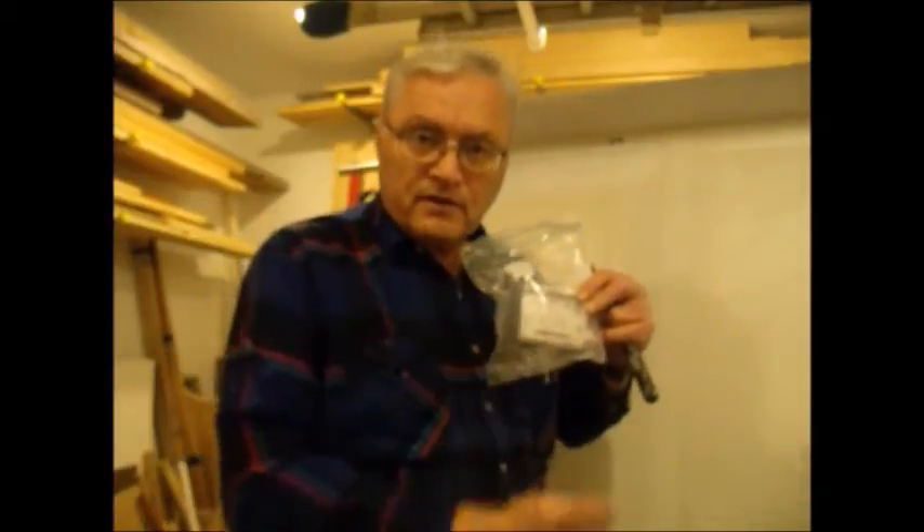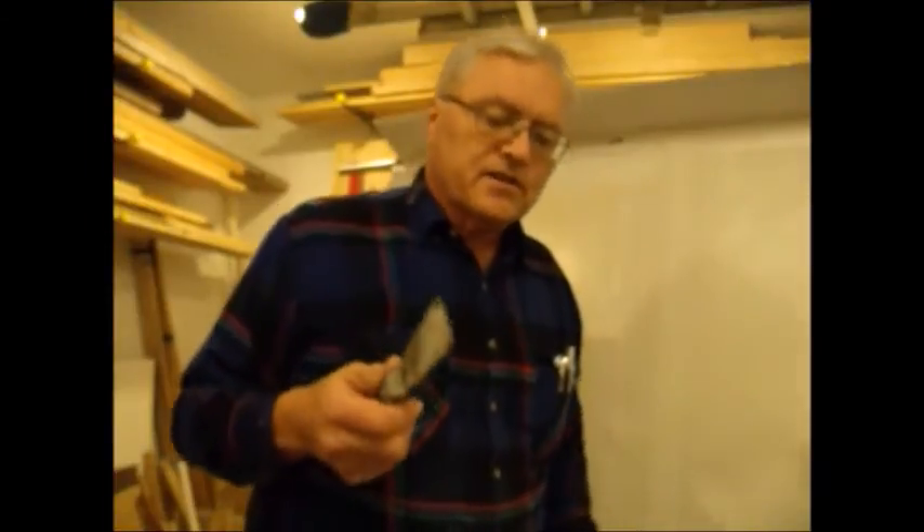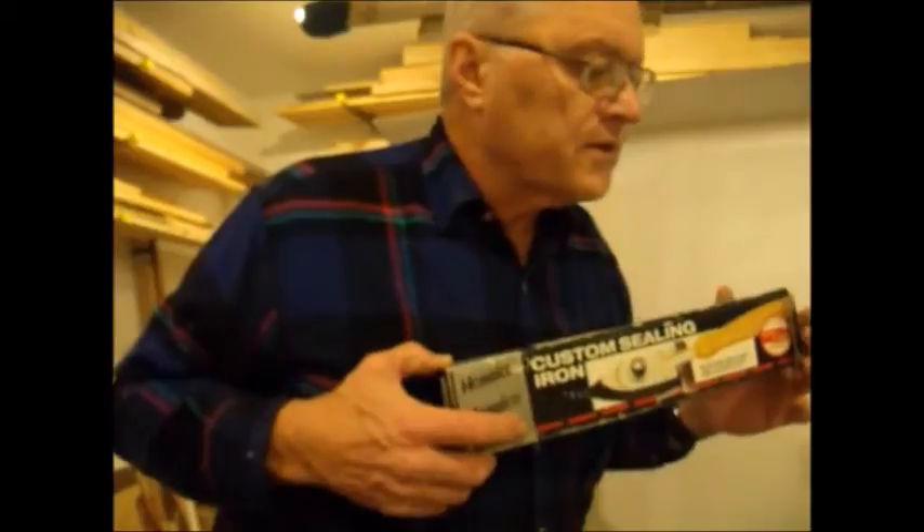The thermometer is made by Farberware — I just got that at Meyers. Another really useful tool is this putty knife. This one's special because it's nearly as old as me and all worn out — the corners are rounded and it doesn't dig in or cut the fabric. Brushes, fabric, a small iron for corners — all handy things to have. Also, lots of MEK. Here in Michigan you can still buy genuine 100% MEK from Clean Strip at local hardware stores, so you don't have to order it from an aircraft supply place.